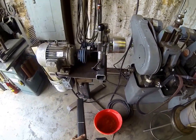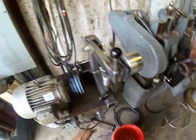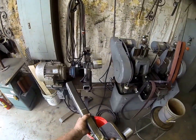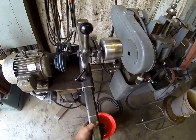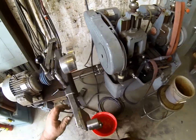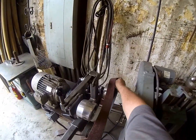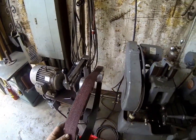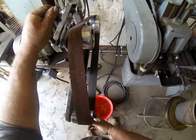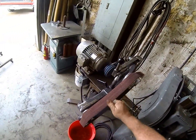We can change this out, pull this out, and set it down in our holder. I built the platen wheel setup — I can slide it into my predetermined line. The platen wheel gives us a little bit of slack adjustment. Put your belt on, put it over the top of the drive wheel, the tracking wheel, and then over your platen, and pull down on the tracking lever.